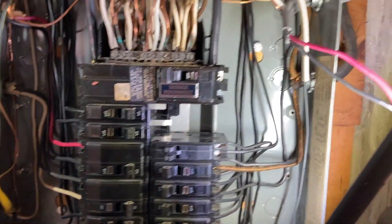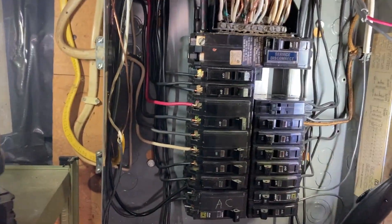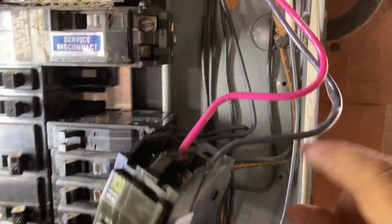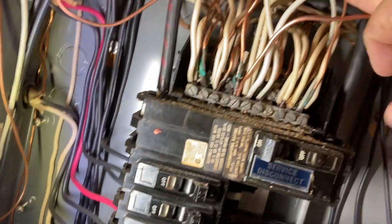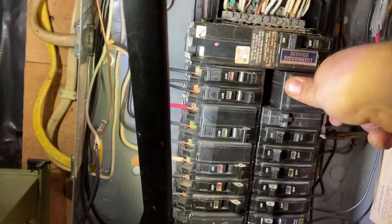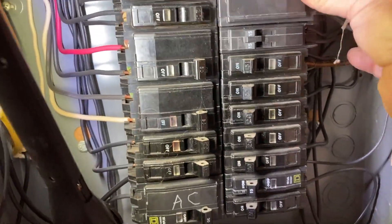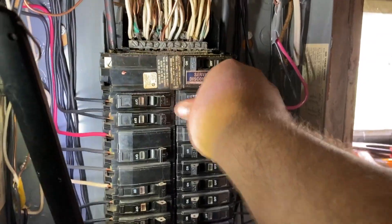We're set, so now I'm just going to strip these two wires, hook them into the breaker, plug that breaker in there, put my interconnect in and I'm set. I've got my wires hooked up to this breaker — just the red and the black go here, the white and the ground go up here. Now we just got to plug her in. Make sure she's off before you plug her in. There we go.